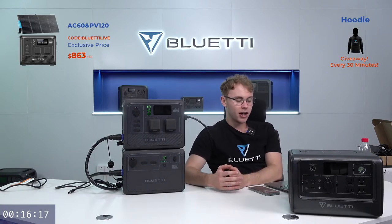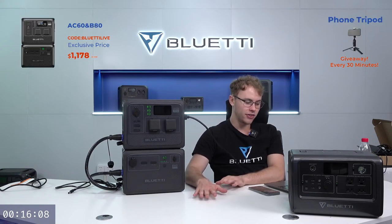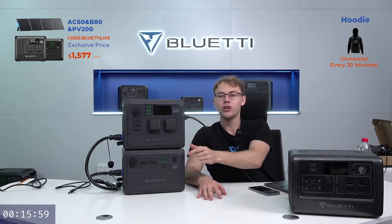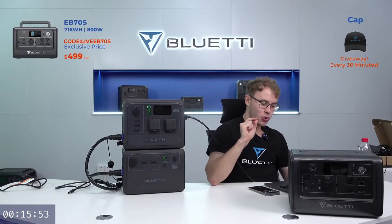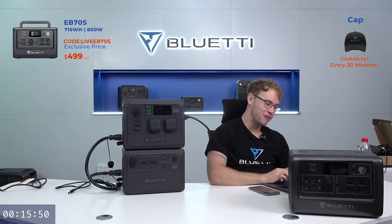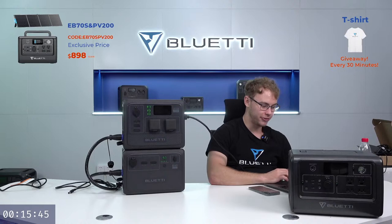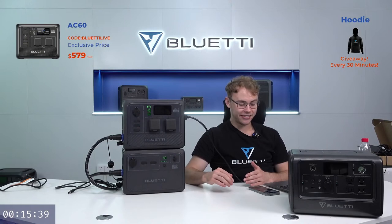So one more time, guys. First of all, with the industry-leading 6-year warranty, just to give you peace of mind. IP65 dustproof and water resistant, expandable from 403 watt hours to 1209 watt hours to 2015 watt hours with two B80 batteries. Turbo charging to 100% in 1 hour, as we found out. And for us, it was even more impressive. It's 1 hour and 16 minutes to 100%, and only 36 minutes to 80%.